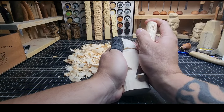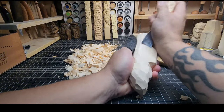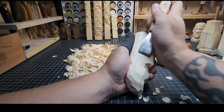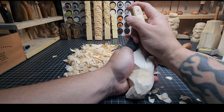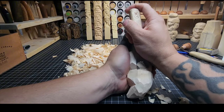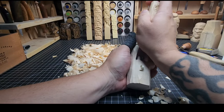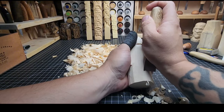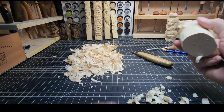I've got a number three KCT gouge — a nice wide flat tool — I like using that for taking off saw marks too. I'll show you how that works. It's good to pay attention to the grain here. Carve with the grain, not against it. If you carve against the grain it will start to chip up and get rough really quickly. On this section it might be best to flip that gouge around and come from the other direction — now it's cutting a lot smoother and easier, not tearing the wood as much.